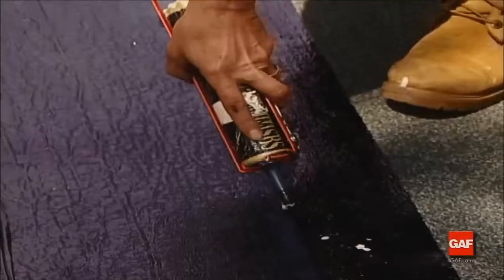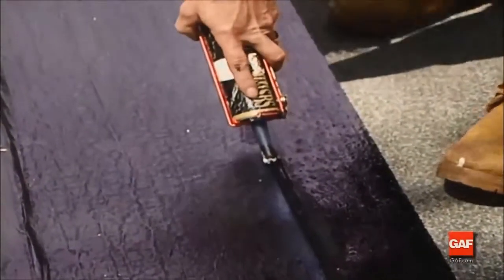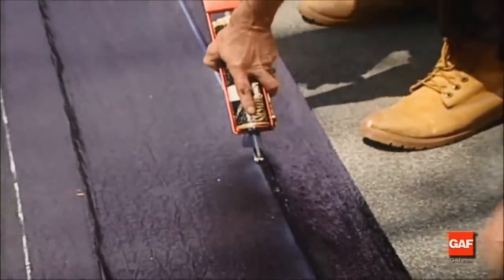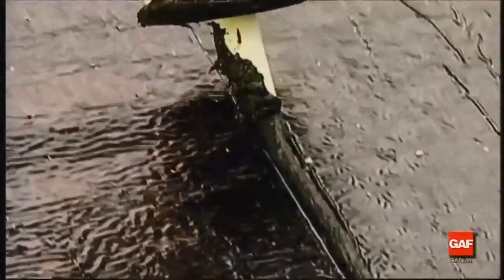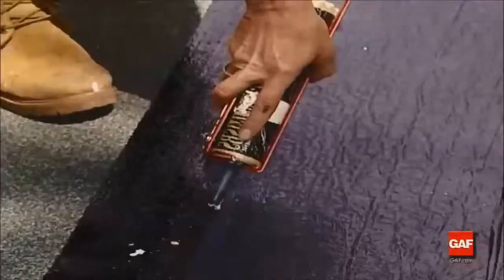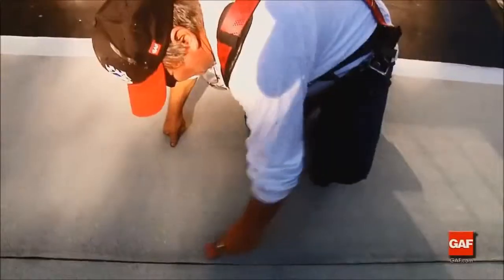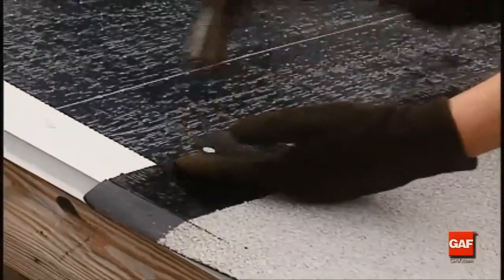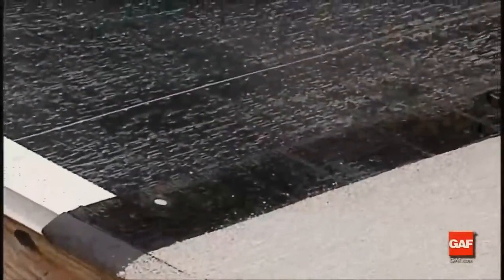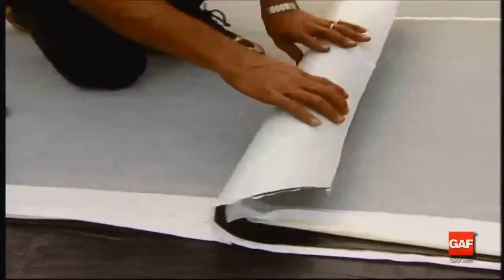Applying a bead of Matrix 201 Premium SBS flashing cement adhesive along the top edge of each cap sheet and at any selvage edge T-joints in any self-adhered system minimizes the possibility of lap blisters forming and seals one row from another. Firmly press or roll the sheet to avoid wrinkles and trapped air in the cap sheet. Due to the thickness of Liberty cap sheet, this weight can pull the membrane down slope.